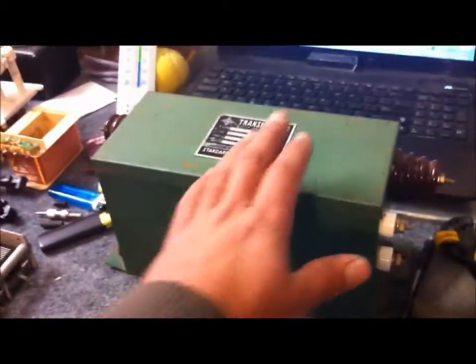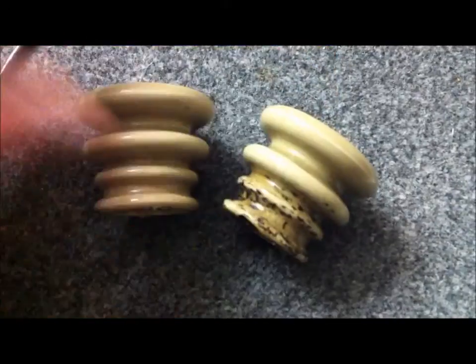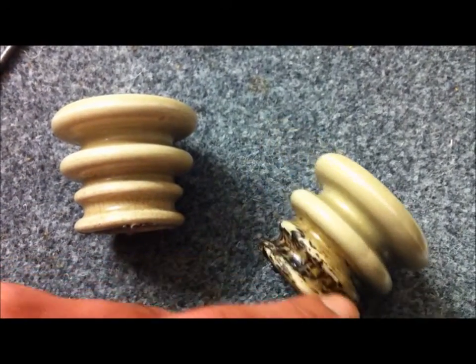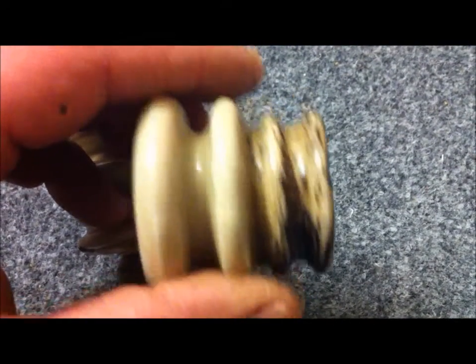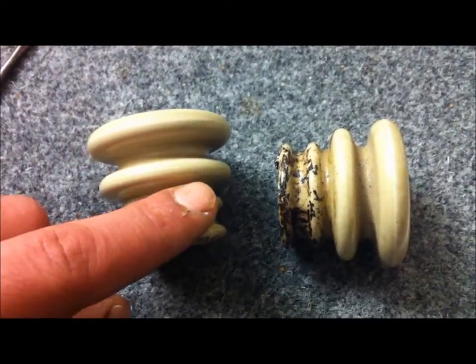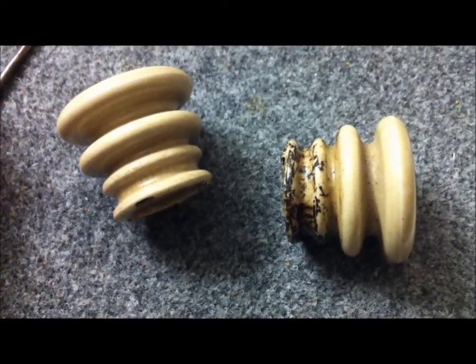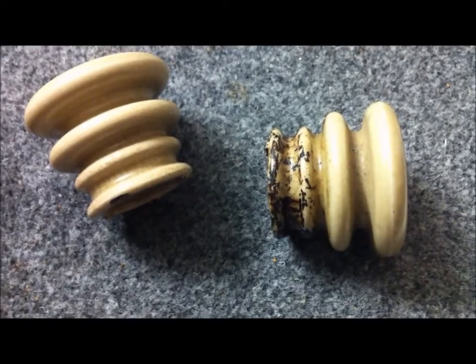Carl gave me a couple of these and I've taken one apart to salvage the insulating bushes. These are the bushes that came out of it. You can see that the one on the left has been cleaned up, and I've left the one on the right a bit dirty just to show you what it looks like after all of the bitumen and tarry stuff has been chipped away. To get it from that point to this point, any sort of multi-purpose lubricant will break that tarry stuff down and it'll come off in no time with a damp rag — RP7, WD-40, whatever you want to use.